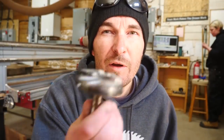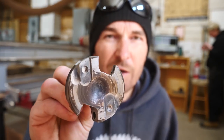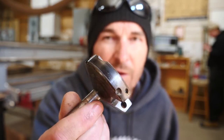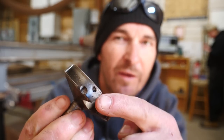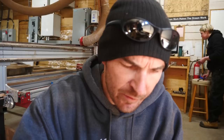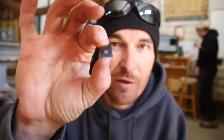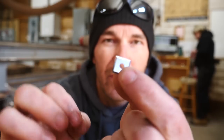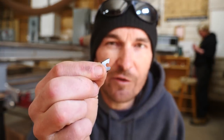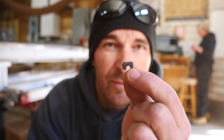Okay so check it out. This is the Amana RC2252. It's about a 3 inch diameter bit and it's pretty fantastic because right here and right there are carbide inserts. Now your carbide insert should look like this — nice and square, sharp on all edges. This is the insert we pulled off. Not a good situation. So we're replacing both inserts.